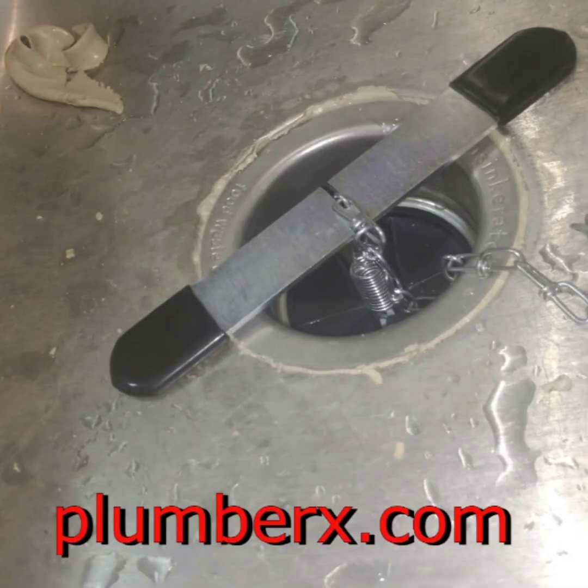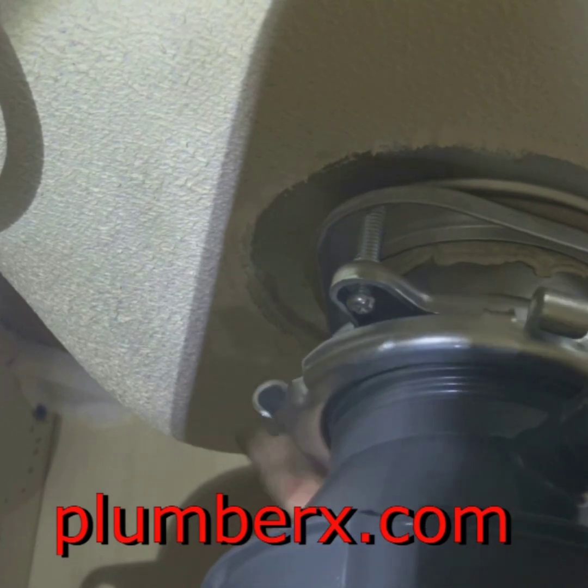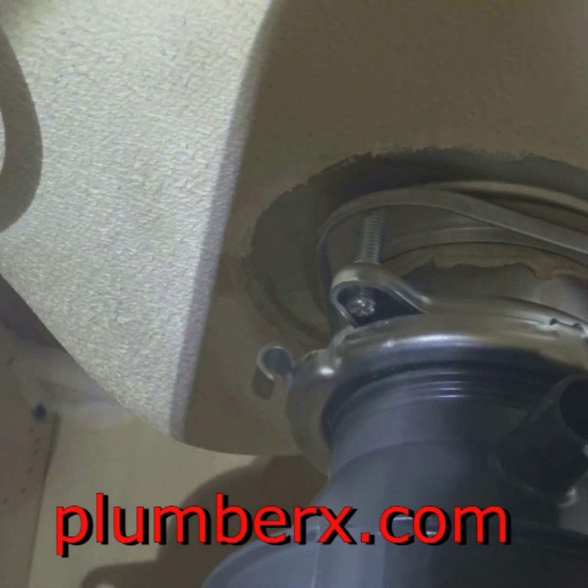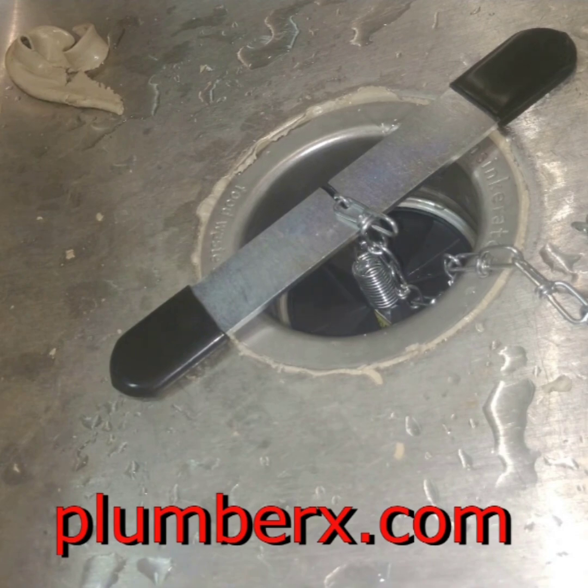And this is another trick that I use. What you see is I'm putting the disposal up in place. Once that is in place and I get it locked down, I usually shake it, because sometimes up under here in the tight spot working, you don't see the side that may not catch really good. If it's loose enough when you shake it, you're going to know that you haven't done it right, so you just pull it back down and then make sure that each slot is caught so it'll stay in place.